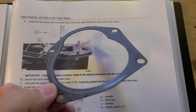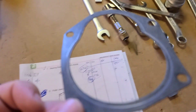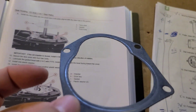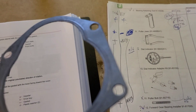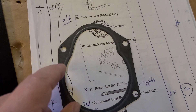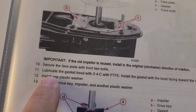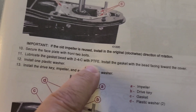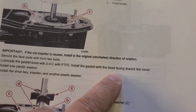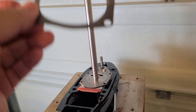The next is the second sealing and it's quite special. That is the part number and it has what is called in the service manual a gasket bead - that is the surface that makes the sealing. It says we should lubricate the gasket bead with Teflon and install the bead facing toward the cover - and the cover is that one. So we lubricate this with Teflon and install it this way.